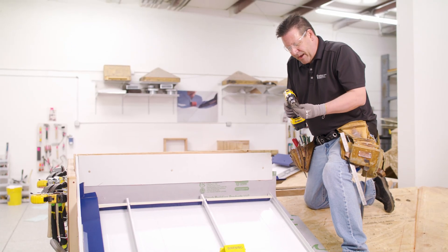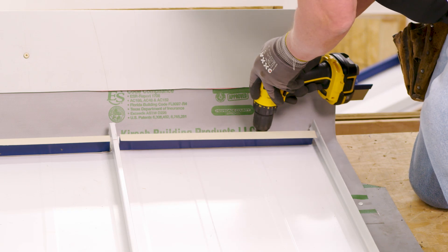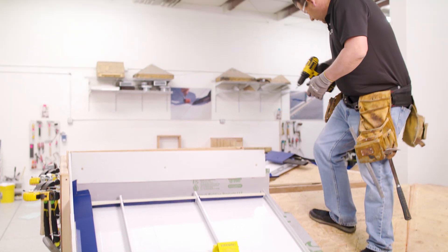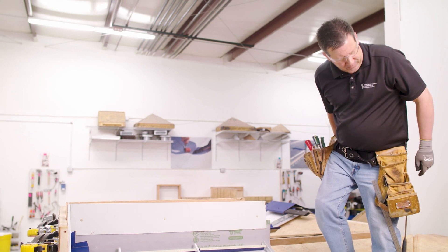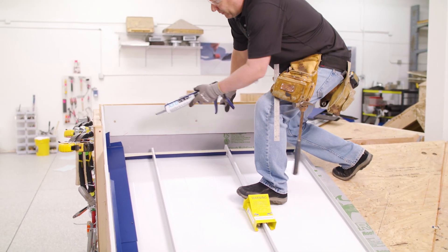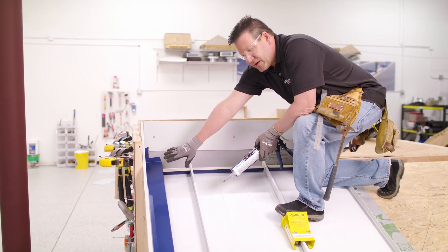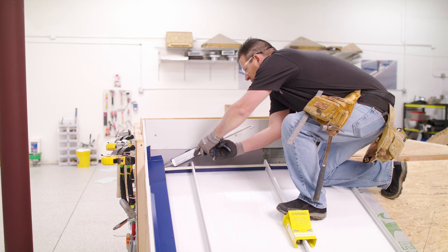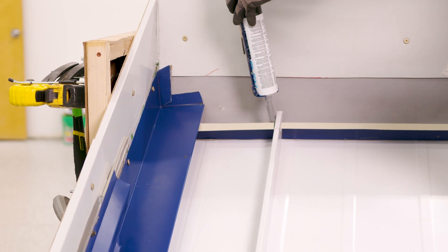These are attached with the 10x1 pancake head fasteners. Once the closures are installed, we add the vertical sealant up and over the panel ribs and on the inside corner — the inside miter to the side wall. Remember, we always work low to high, so our side wall flashing is already installed. The Z-closure for the side wall is extended beyond your head wall, and now we caulk the inside of that corner and then come up and over the remaining panel ribs.